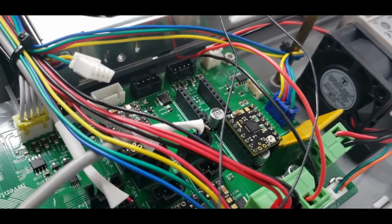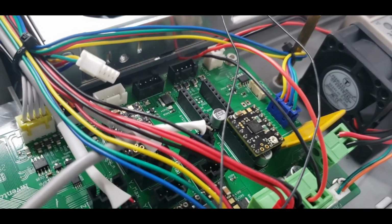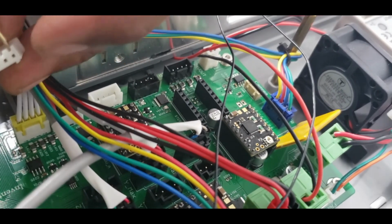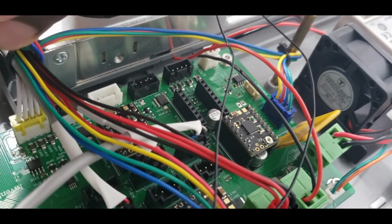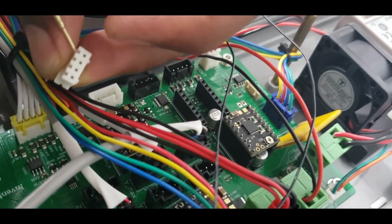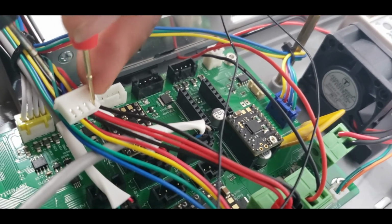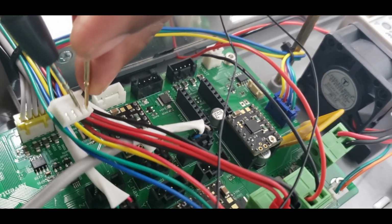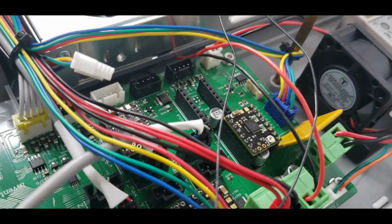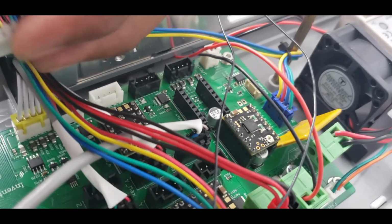They're in a phase. If you want to make sure, they're typically right next to each other. But what you can do is, if I can plug this in here, you can hold the 2 pins, and if you check continuity, I'm just in a diode mode, it beeps, so I know that those are the same phase, same coil. And I have verified that now with that check.